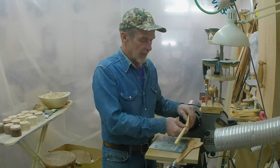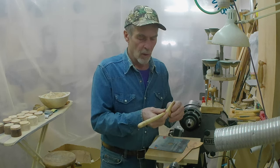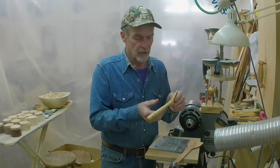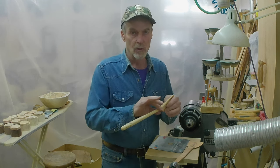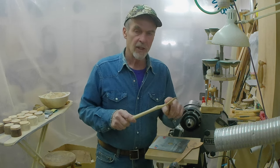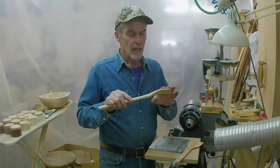This length is going to pose some vibration. I don't go through heroic efforts to brace it. I give it some hand support. I go for it. If I don't get it completely smooth in there, I remain optimistic and do a little sanding. But really, not that much sanding is involved, except where I shape this on the 60 grit belt on a stationary belt sander. It's very quick.